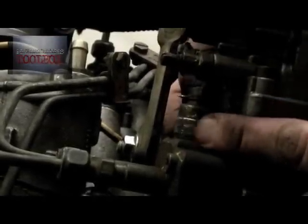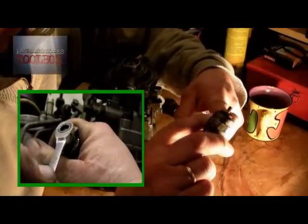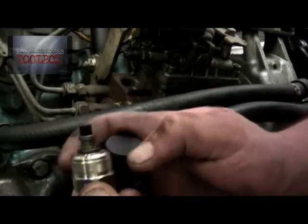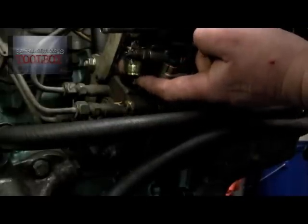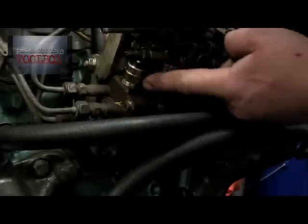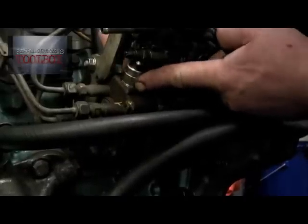Once you've got it off, be aware you've got to take the tab off because they come with one fitted. There is also an o-ring — make sure that goes back in properly. That is the seal stopping diesel from leaking past the valve. When dropping it in, hold the plunger and slip it into place, nip it up, and the job's a good one.